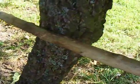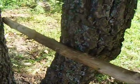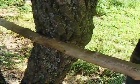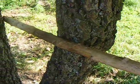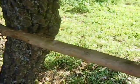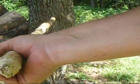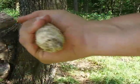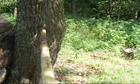You can see this is right where that bend was, and I'm actually bending it over the other way a little bit - that'll help pull that out of there. We have to wait here about two or three minutes for it to cool off, and we might be in pretty good shape after this. I'm just testing now to see if we've got that kink out, and I think we do. It's looking pretty good - you can see that's much straighter than what we had before.